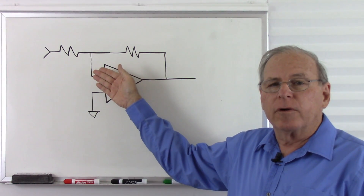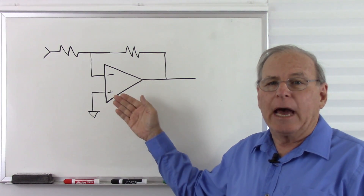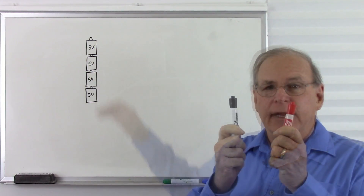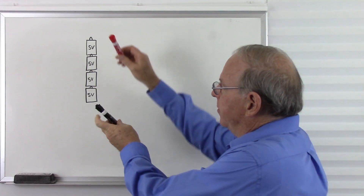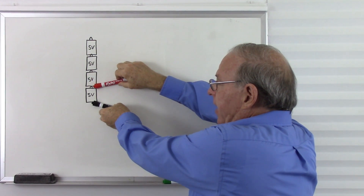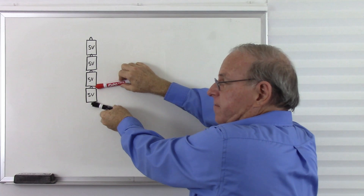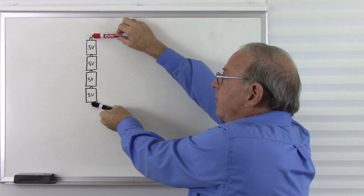When we look at this ground and this virtual ground, it's important to remember that zero volts is not the absence of voltage. Here I have four five-volt batteries giving us a total of 20 volts from here to here. Using these pins as a virtual voltmeter, I read 20 volts across the full stack, and 5 volts across each individual battery. Measuring cumulatively from one end: 5 volts, 10 volts, 15 volts, and 20 volts.